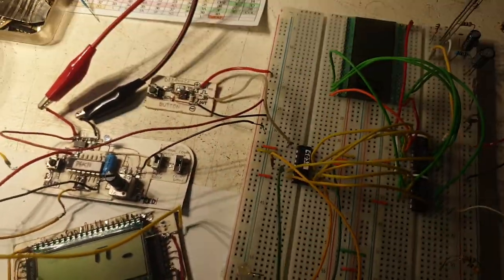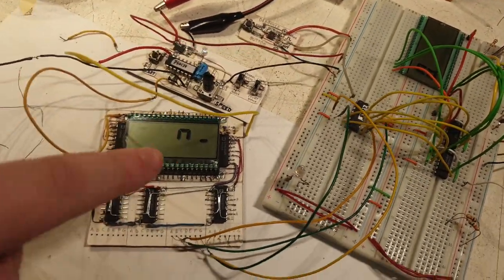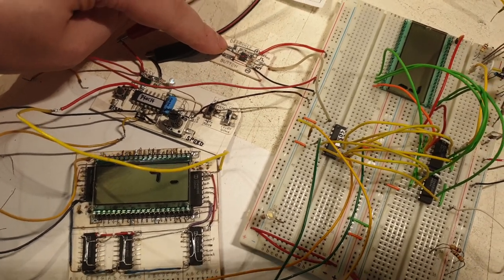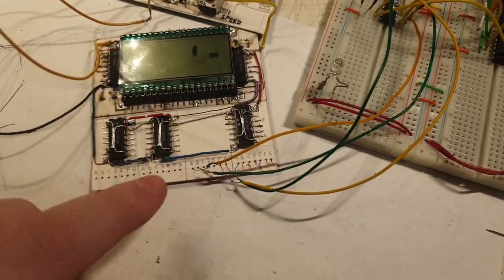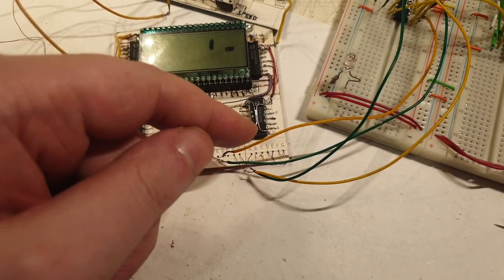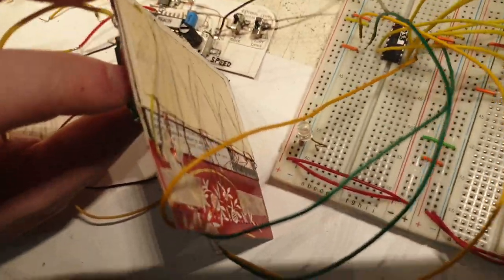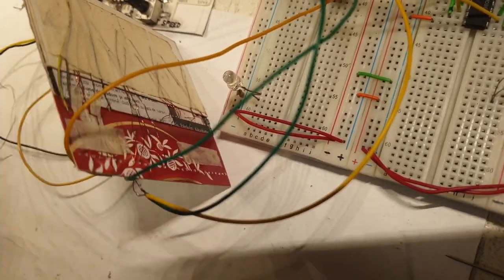When I switch now I'm getting half a digit. Watch the second digit — when I press: two, three, four, five, six, seven, eight, nine, zero, one — running exactly as expected, which is absolutely phenomenal. I still need to connect the last three chips — take one gate from each and link the remaining pins to form the final digit. But I wanted to show the progress. On the other side, the wires aren't secured yet but they'll be glued to the cardboard.